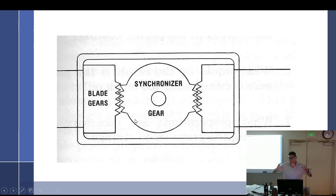You need a synchronizer gear to keep the blades always moving the same. The blades are wood and the hub is metal. There's a synchronizer in the hub that ensures the blades move together. You also have stop bolts that set the high and low blade angles.